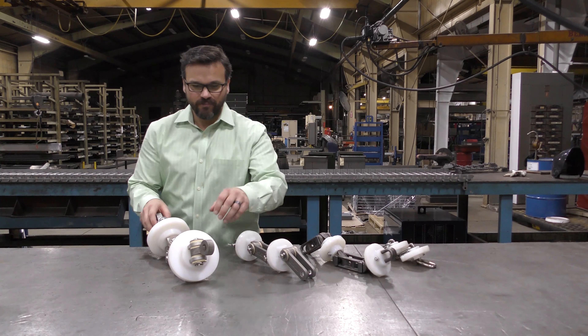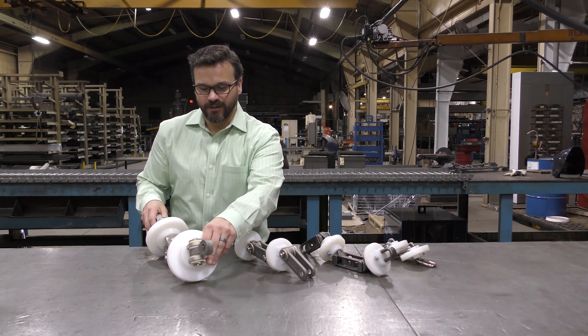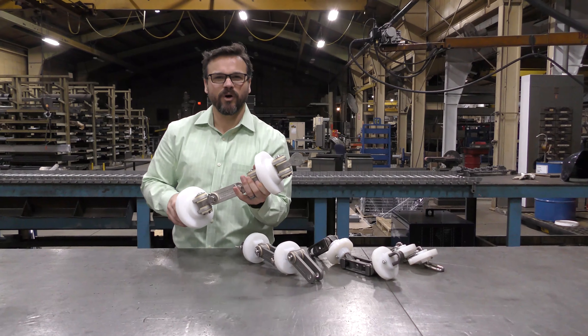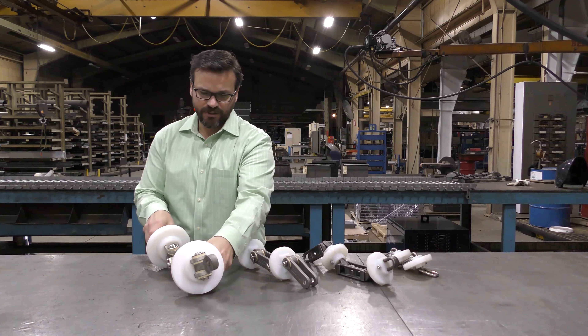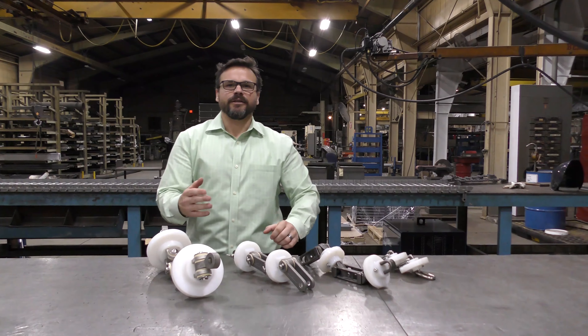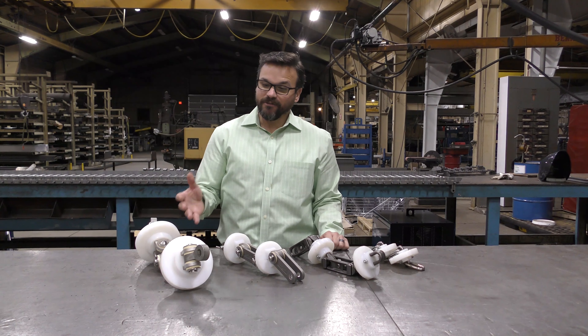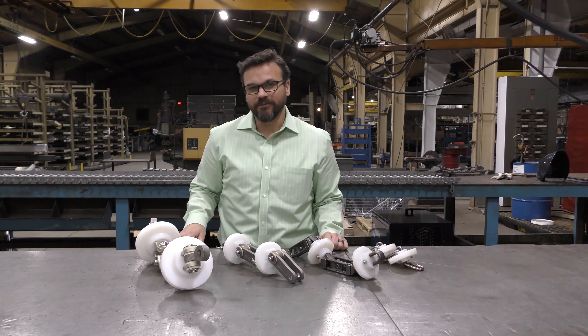The fourth type is what we call a uniseal. It is a sealed pin design, except in this case every other knuckle articulates 90 degrees from the one prior. It gives you the opportunity to bend in different ways in a short period of distance — something we try to manage in the circuitry design, because we don't really like to have a lot of bends in a circuit. So if it's unavoidable, we have the solution for it.